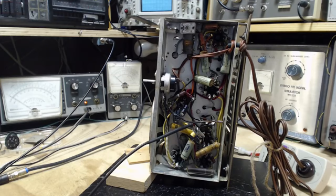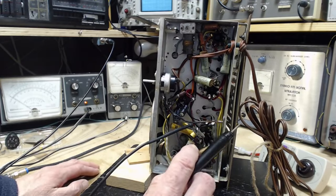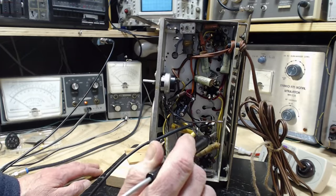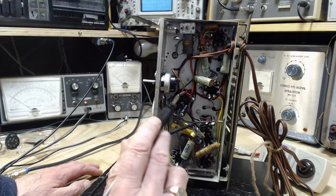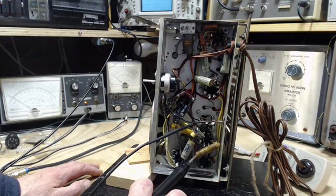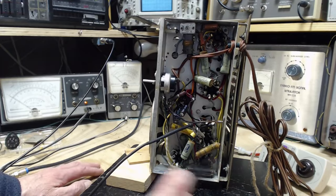You can get higher. You know, you're starting with 120 volts. And if you full wave rectify 120 volts and do it very efficiently, you can get 169 volts out of it in a power supply in a radio like this. But you'd be lucky to get 140 in most cases. This one I think just has a half wave rectifier in it, so you know you're down around 110, 120, just like it is here.